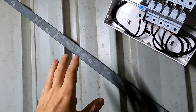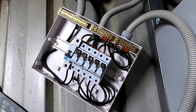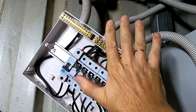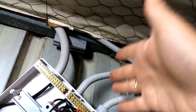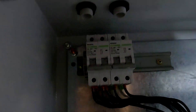This is flexible enough so I can continue mounting my panels and posts. I've done the same with the west roof — these two cables here go in the conduit and the combiner box is up there on the roof. It will stay there while this one goes onto the panel, because it's so close — only about 30 centimeters above where the panels are. DC input is now completely disconnected.